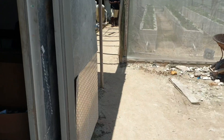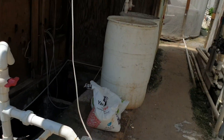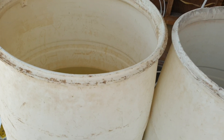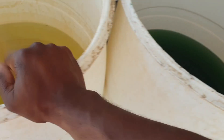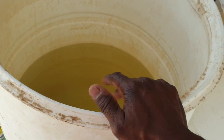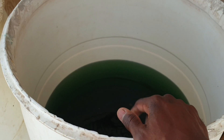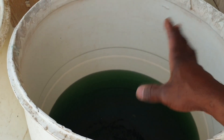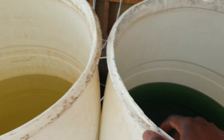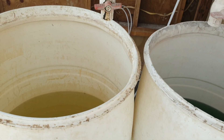So let's go over to the Stock A and Stock B station. These are the two concentrated tanks. This tank has the Veg Grow, and this one has the potassium nitrate and the calcium nitrate. You could also mix the potassium nitrate with the Veg Grow in the same tank, because there's no calcium in either of them to cause precipitation. Just always ensure that the calcium is not mixed with any phosphate or sulfate.